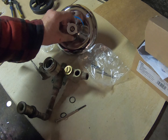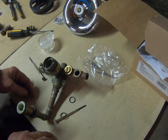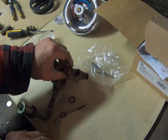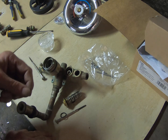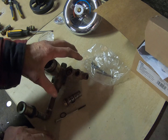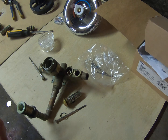I'm going to show you the difference between this valve and the positive temperature control valve in the second part of this video — please hit the like button, ring the bell, and subscribe. If you have questions, leave them and I'll answer them. When I soak these, I use either CLR — calcium, lime, and rust remover — or PB Blaster, sprayed right in there and left to soak. After everything is done, turn the water back on to flush out the system, apply some lube, put it back together, and that's it. Thank you for watching.